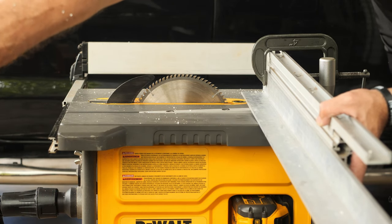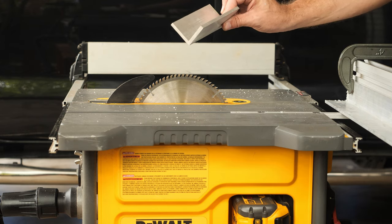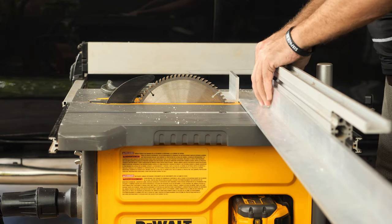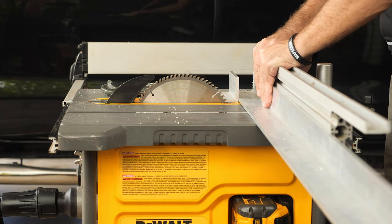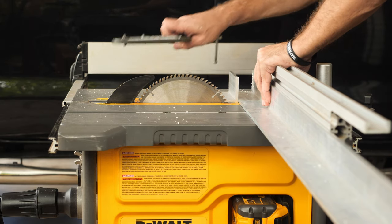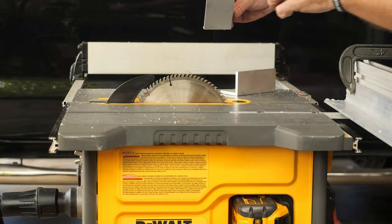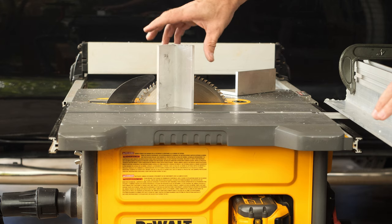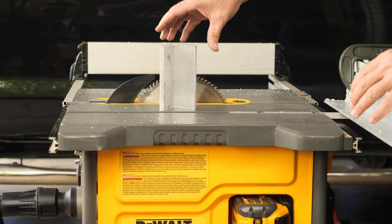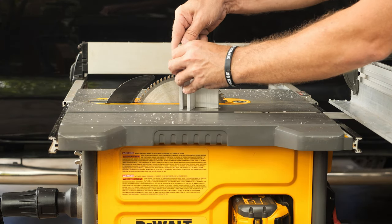The two pieces of aluminum angle will be bolted together, and then I will only drill the caster wheel threaded inserts. I can use the piece already cut as a reference to make the remaining pieces identical. Remember, we want to cut on the right side of the blade — I honestly made this mistake thousands of times. The cut quality is very good, which proves the table saw is perfect for cutting aluminum. Comparing the two pieces — the same size, good cut quality.